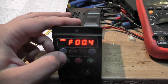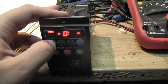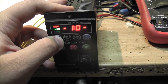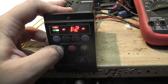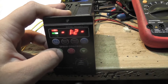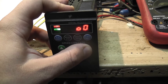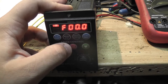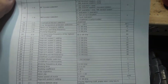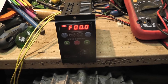I just have to configure it — I already ran it, but I need to set a few things. On menu 1.2, I set the brake to 0 to turn it off. The rest is already configured for 50 Hz. Finding a datasheet for this drive in English is not easy, but I'll link one in the description. Let's turn it on.